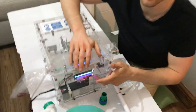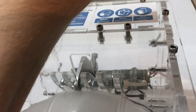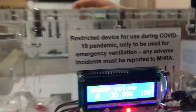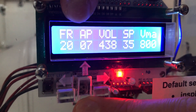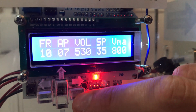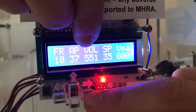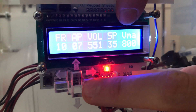On the display, we can use these buttons to move the motor arm up and down if there's a problem with the starting position. The screen says press the right-hand arrow key to begin, so you press that and it starts. FR is frequency — breath frequency per minute — which you can adjust up and down. AP is the actual airway pressure, showing the maximum pressure reached.